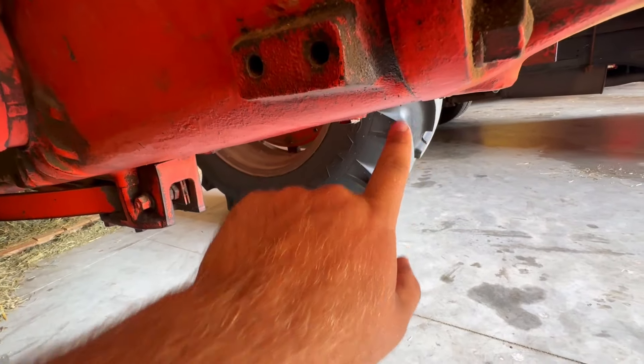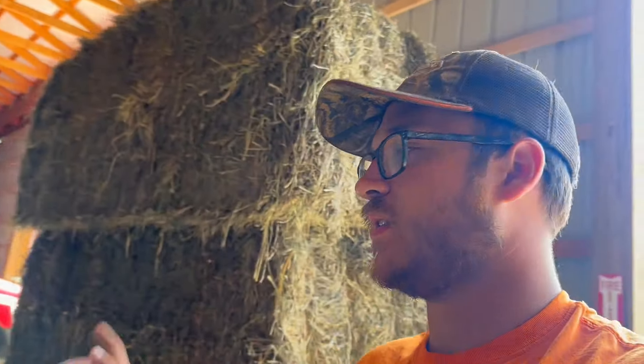It's leaking right there and dripping, and it's also leaking hydraulic fluid right here. I don't think we'll have any problems if we keep running it through the rest of the season, but it should be split at some point over the winter or sometime relatively soon, and that front end needs rebuilt.